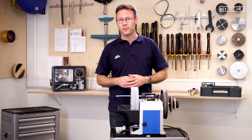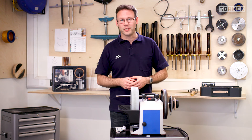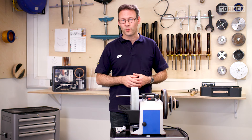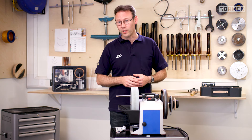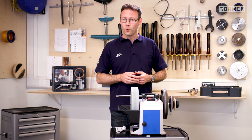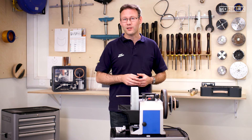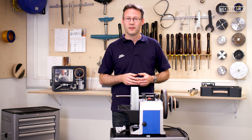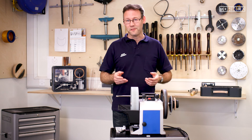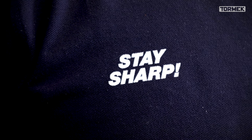Now that my tools are sharp, it allows me to focus on the important things in my workshop — bowl production and working with my students. You too can easily get professional sharpening results with just a little guidance and some practice. The most important thing to get right is paying careful attention to the jig settings, especially the protrusions when using the TTS-100. When you get these little things right, sharpening really only takes seconds with most tools. The Tormek marker method is a great way of getting consistent results — it saves steel and saves the wheel. Thank you for watching, and remember — stay sharp.